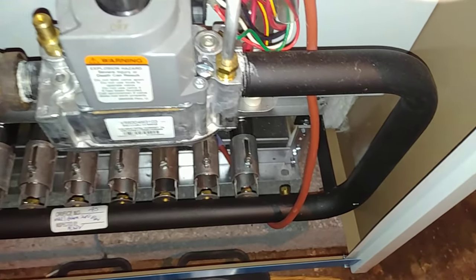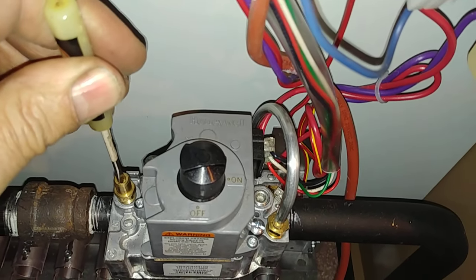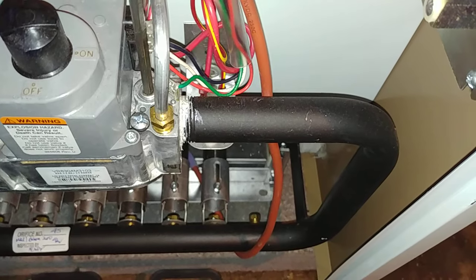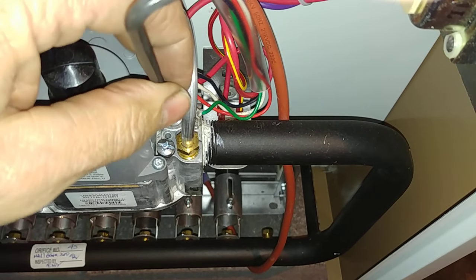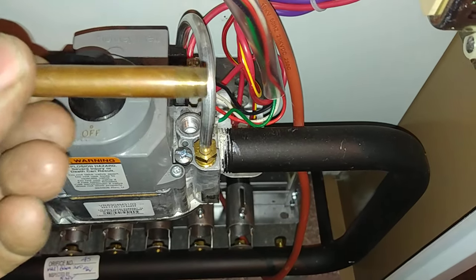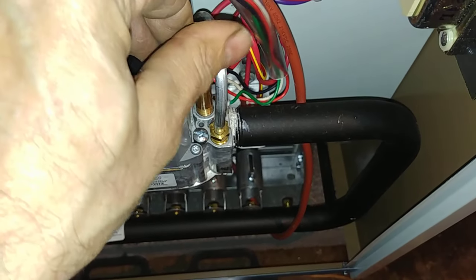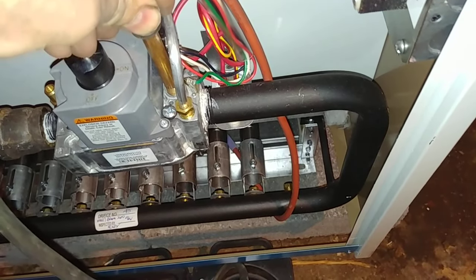So if we take this tap out and set up our gauge, we would see what the actual downstream gas pressure is. I'm going to turn off the gas, take that out, and this has a little screw which I can shut — that's really nice. I'm going to take my three-sixteenths hex; I've already had this out, these things are ground in pretty tightly. I'm going to put a one-eighth inch nipple in there and snug it up, then put our hose on there and turn the gas back on.